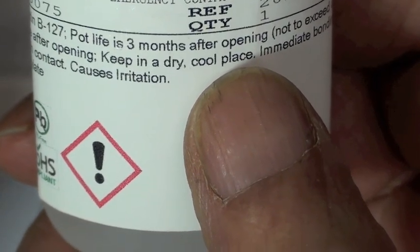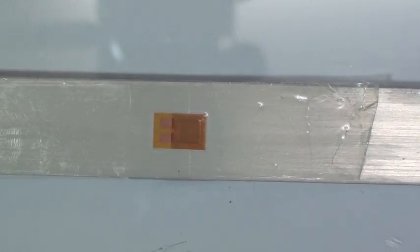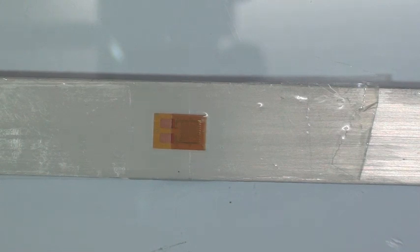The reason is because when you squeeze out a drop of the adhesive and release the bottle, it's going to suck some air back into it. Well, that air has humidity in it. And what will happen if you put it back in the refrigerator, that humidity will then condense out into liquid water, and that will degrade the adhesive very quickly. So in general, once you pop the top on them, keep it stored at laboratory conditions and don't put it back in the refrigerator.